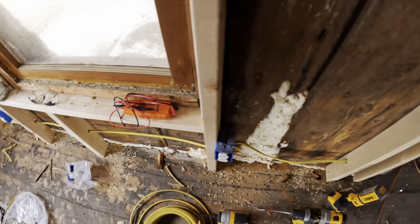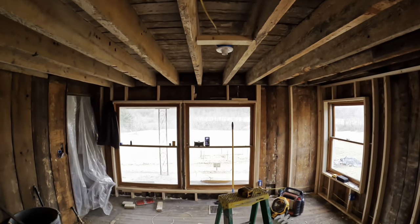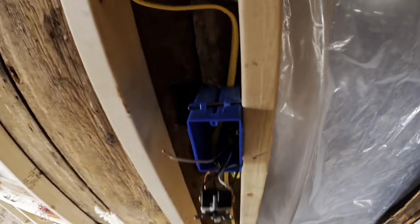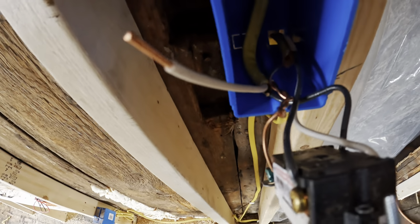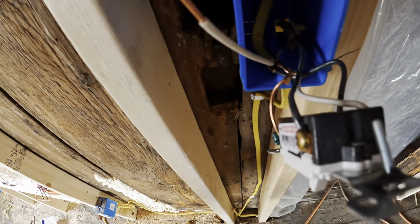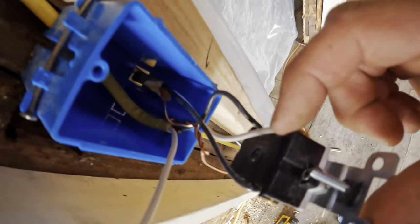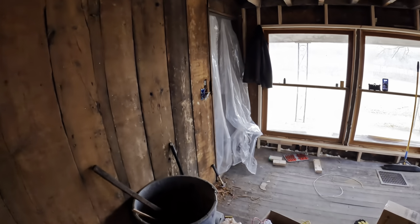I've done quite a bit of wiring. I've done everything here with the new services and everything. Temp light up there. I have never wired a three-way switch, so you can see all that fun. And I didn't have any 12-3 wire. All I had was 12-2. And I just don't like the fact that I have a white wire right here that's supposed to be red. These two are what they call travelers. And that's what travels the current between this switch and that switch over here.